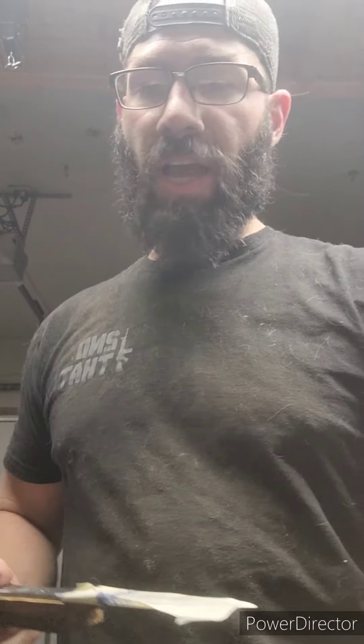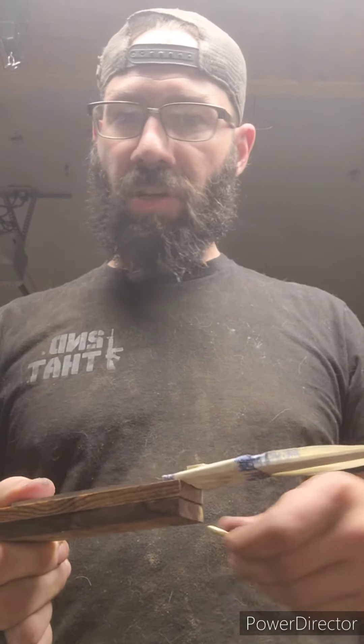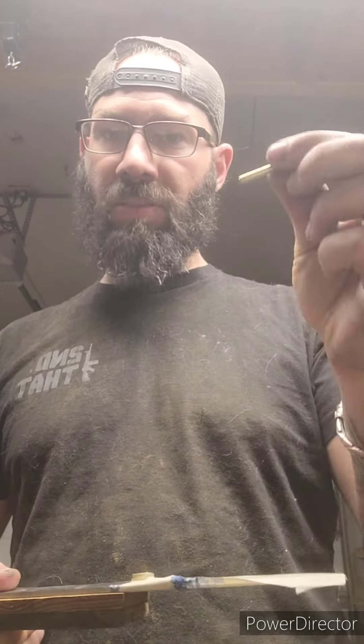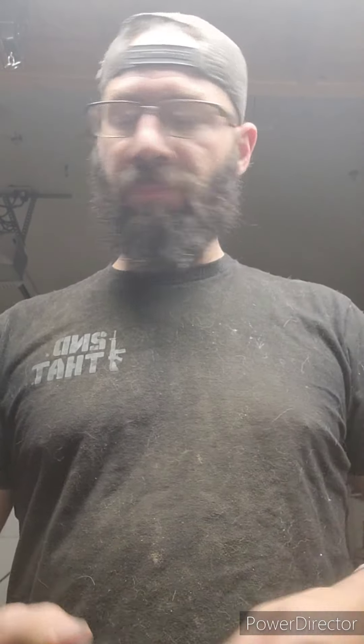Whatever size pins you're using — I'm using 5/32 for these steak knives — after I drill my first initial hole, I take it off the drill press and I take what I call a shaping pin and drive that in. This is not a pin that's going to go into the knife permanently; I use pins for different things. This pin is going to be wedged in there and it's going to stay. Then take it back to the drill press, drill the next hole, take it off the drill press, pop the pin out, take everything apart, and then you're going to do a mock assembly, as you'll see in the next part. Look for the next video.